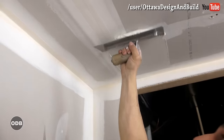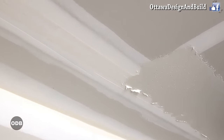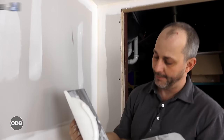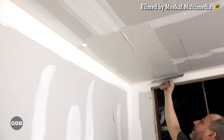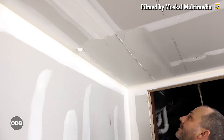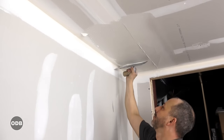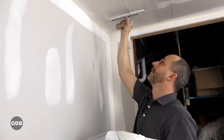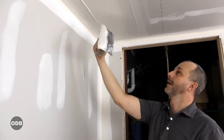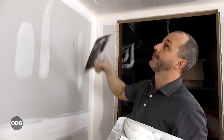It's the same process. You're just going to fill down one side, get a good pack of mud. If you collect your mud and put it on your hawk so you don't have much at the top and bottom, it shouldn't land all over your face when you're working upside down like this. Now we want to clean by putting that pressure. You see the ridge is too close. Clean with the pressure on the outside, and then one down the middle on the paper — leave those lines there. That tells us where it is that we fill to and what we have to fill afterwards.